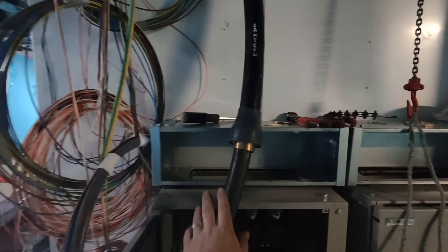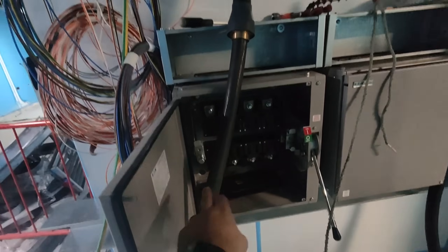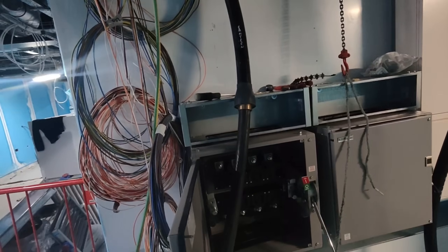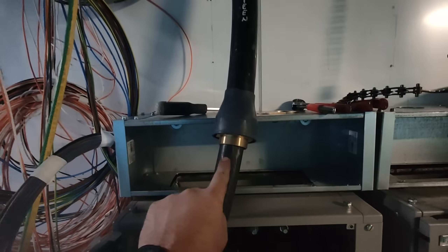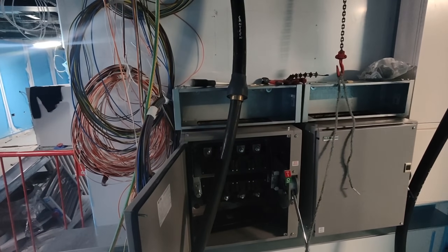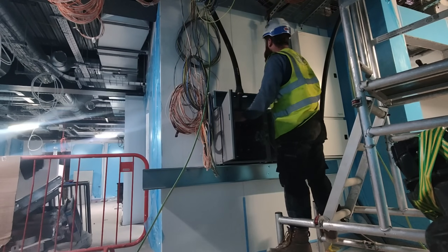See that rotary isolator? Beautiful. Right, I've got the cable glanded. There's my hole with the banjo on. I'm hoping up there there's enough space - there's only 600 mil, that's all I need. I'm hoping there's enough to lift it up into that space and drop it into the switch. I've already done my ring because inside there it'll be very difficult to get your knife around the back. Always remember to do that if you're in an enclosed space - it's best practice. Let's see if we can get it in.